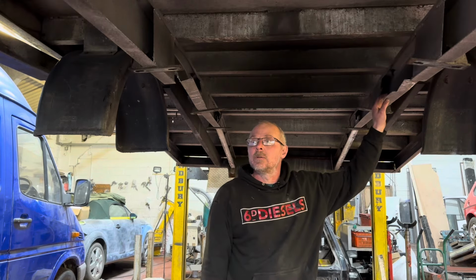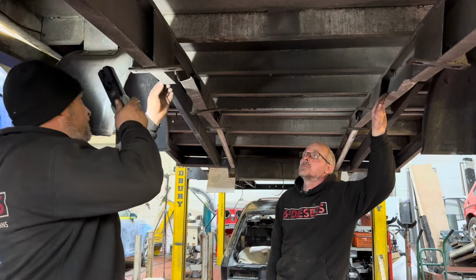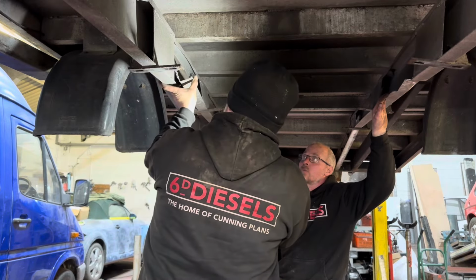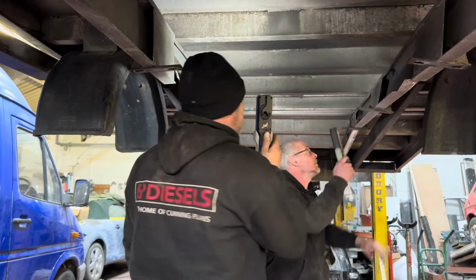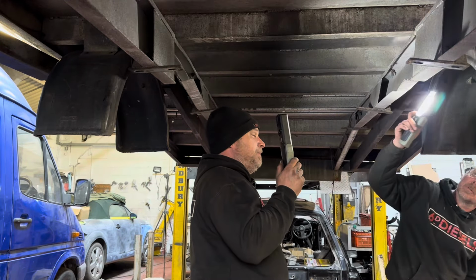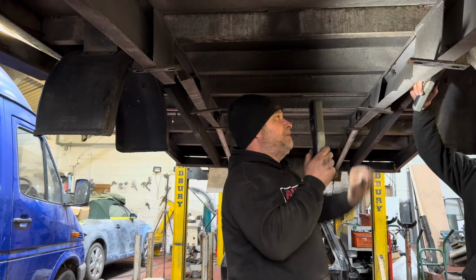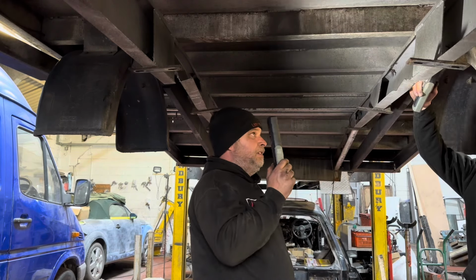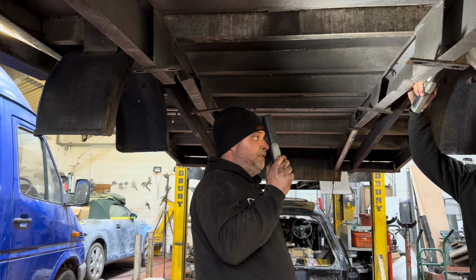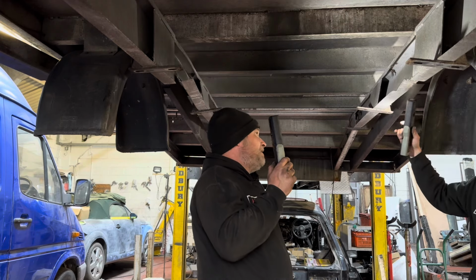Yeah. And I think, to be honest, I don't think that's broken there. I think that's two pieces of aluminium joined. It's two joined together, and it's just the weld snuck by the side of the weld. Whether it's even worth trying to weld it. I mean, we can alley weld it. We got the alley MIG. We're going to have to clean. On this side, obviously, he's had some double. Yeah, I mean, there's some proper bird snot going on there. Yeah. So we could just plate it, bolt it, because to be honest, once it's down, it shouldn't move.